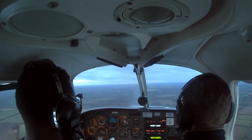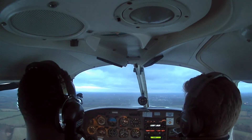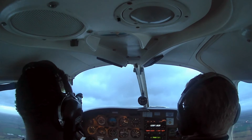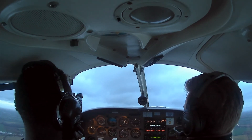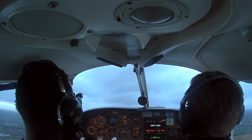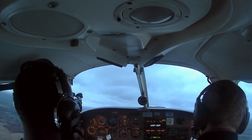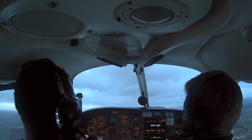If I get the carb heat back off, I'm going to go to full power. We're going to be still at 70 knots — you see, the airspeed hasn't changed. The only thing changing here is the power setting. I'm going to trim myself out for that — round about there somewhere. And now just have an experiment again with the elevators and the rudders and see how that feels. The ailerons are unchanged.